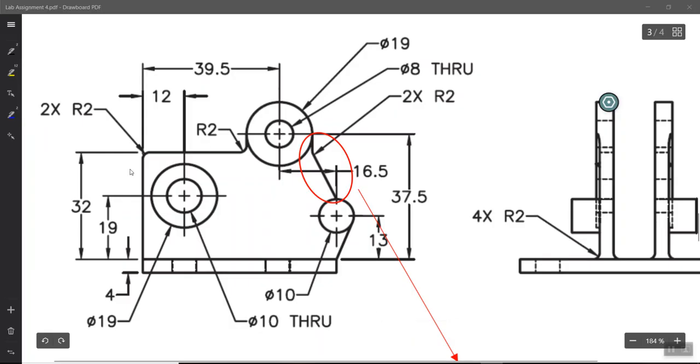Okay, this flange is a little bit tricky, so what we're going to do is make some of the lines, and then put these circles in, because we can take them over and then make them tangent, and that'll make this whole thing a lot easier. So we'll make this first line here. We'll take the line over to some distance, and then we'll make these other lines later on after we put these circles in. Because you see these lines, they didn't really give you an angle, and this line is a little bit tricky here. There's no real easy way to define it if I just try to make these curves. So it'll be easier to make these two and then make the circles, and then define these other lines off of those.